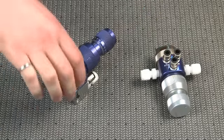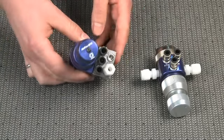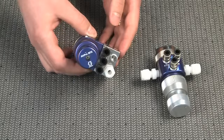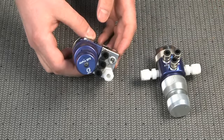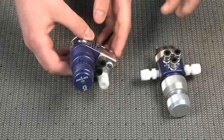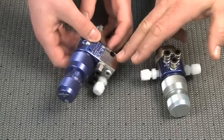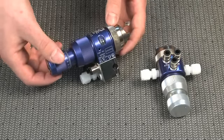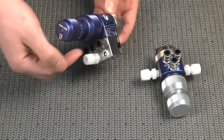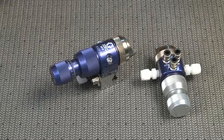The second style has a manifold, where the fluid and air connections are in the back of the manifold. This one has only one fluid port and has been capped, so it's not for circulation. The main benefit of the manifold is servicing — it's easy to take offline without disconnecting all your fluid and air lines, and when you reconnect it, your manifold is still blocked in the right location.